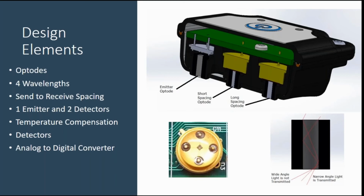And with the Moxy, this is another feature of that LED mount, those 4 LEDs are mounted on one big brass plate, or brass disc, and because there's copper in the brass, that makes it a good thermal conductor. So all 4 of the LEDs are at the same temperature all the time because they're mounted to this nice metal mount. And then we can also sense the temperature of that metal mount, and we can then accommodate any variations in the color of the LEDs. So whether a Moxy is warm or cold, it's still going to measure accurately, and that's pretty important when people might be in a swimming pool or coming out of the pool, or the athlete might be wearing it under clothing where the sensor warms up a lot. A lot of those things are important to deal with.